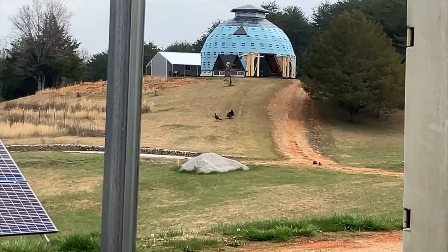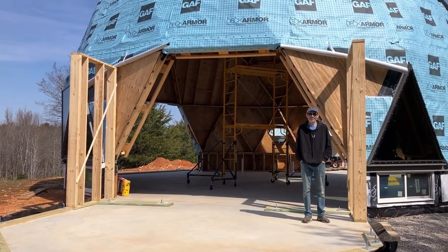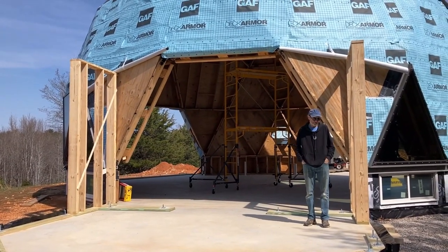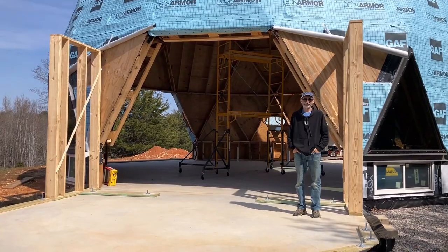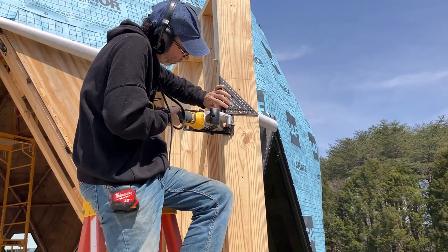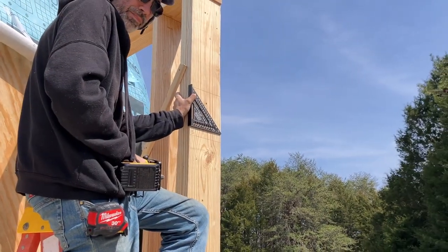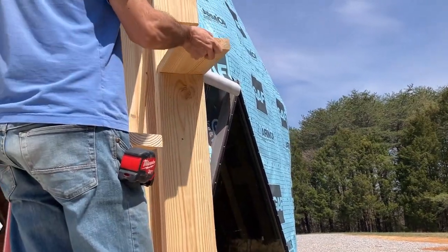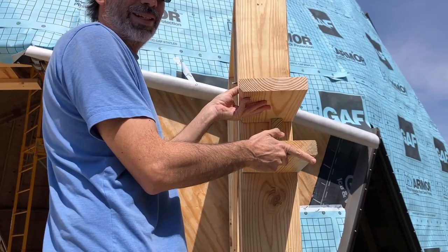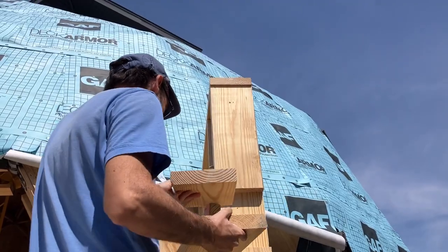The turkeys are hanging out in front of our dome — it's still standing! Today we're going to put the next course up. Next up, we're going to fix yesterday's mistake — we forgot to frame out the jack stud for the door. We'll turn that king stud into a jack stud. That goes like that, and that goes like that. It looks great — barely any wiggle room. Back in business!